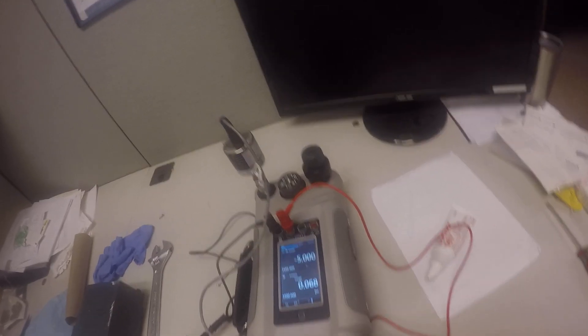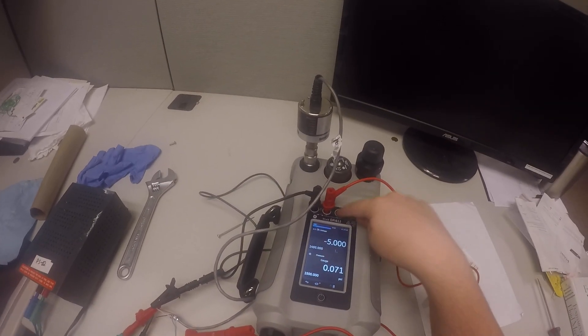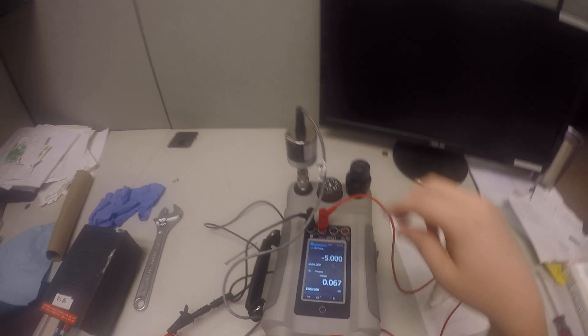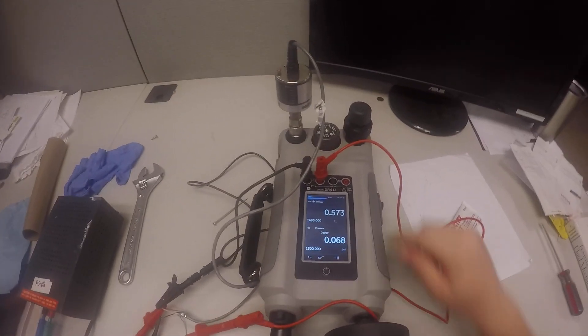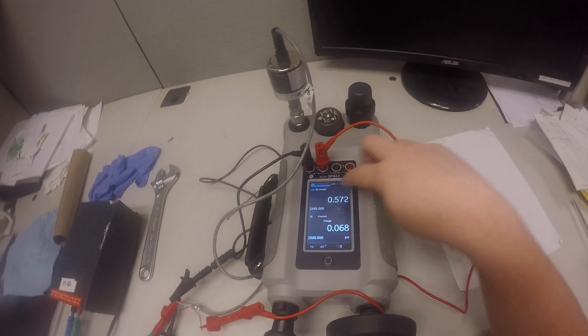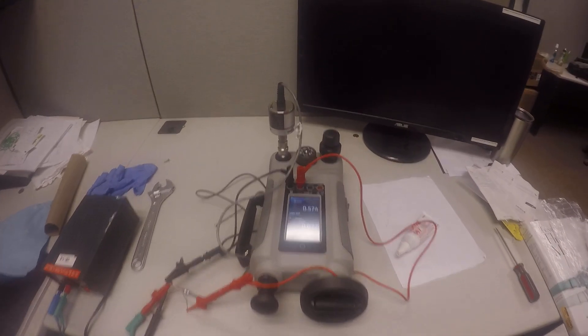If your transducer has under 10 volts excitation, you can use these two ports on the right side to extract your voltage. We're pretty much ready for the test. We're going to turn on our power supply. Now you can see that the top section jumped from negative 5 to 0.5 PSI — that means it's measuring a voltage, so we know we correctly set that up.